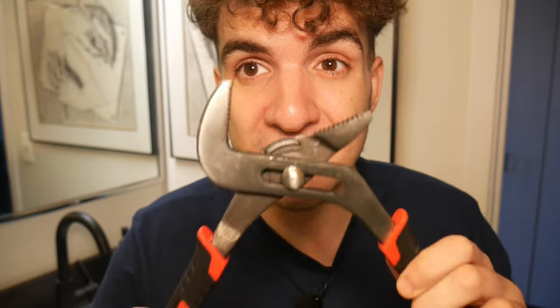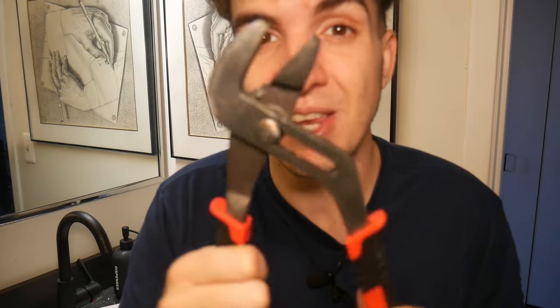The main thing you'll need is a nice set of pliers — they need to be big pliers. These are oftentimes called plumber's pliers, and they're crucial for fitting pipe, removing the old drain, and installing the new drain. You'll also want some sort of receptacle because when you remove the old drain there's a U-pipe that drips water, so you want to catch it somewhere. And lastly you'll need some Teflon — if you're doing metal to metal connectors you're going to want to use a little bit of this to really get a good seal.